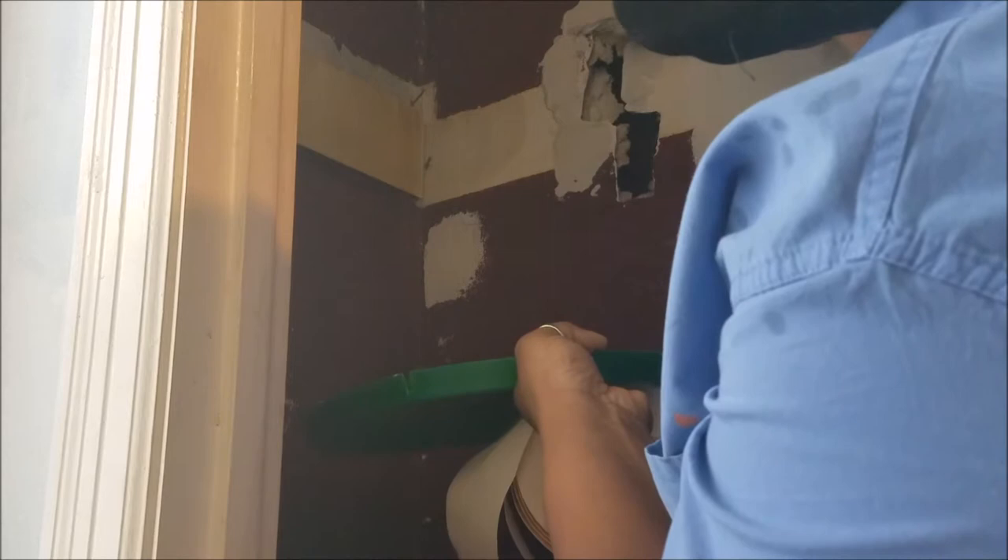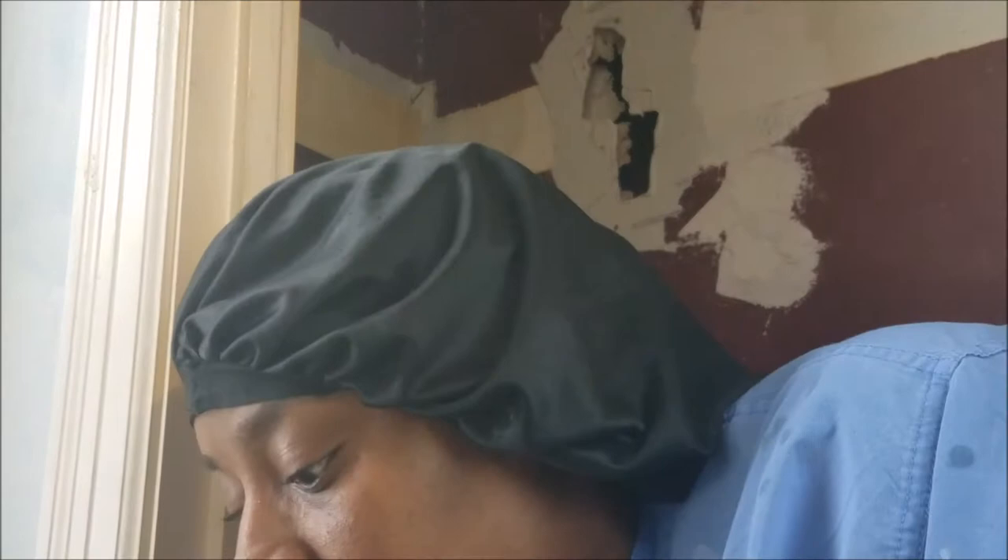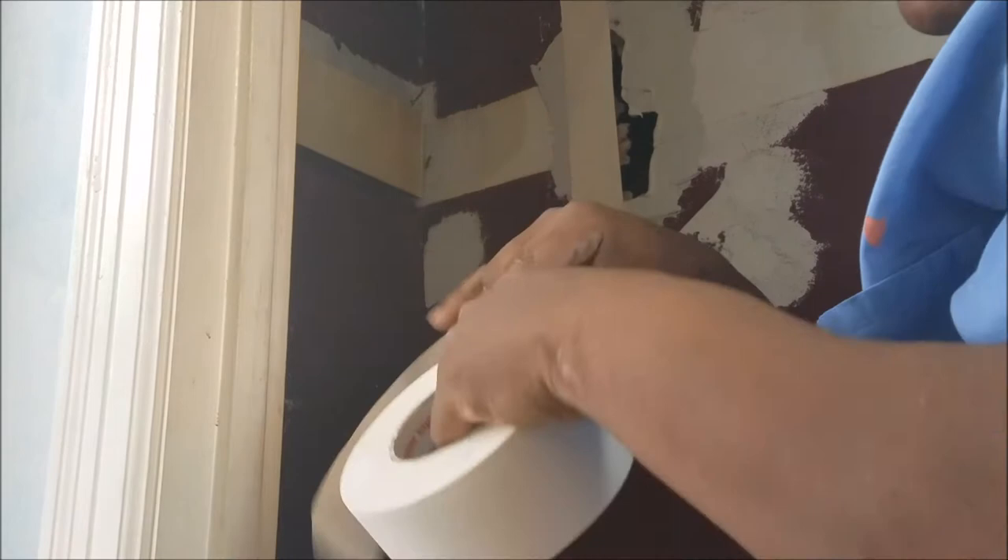It's time to put the tape up. You just want to get some sheets of tape, rip it just a little bit over the hole — maybe an inch or so on each side — and make sure you press the tape firmly into the joint compound. When I say skim coat, that means you don't want the joint compound really thick, just enough to grab the tape and make a nice firm adhesion between the two of them.